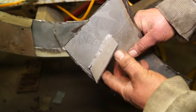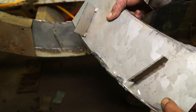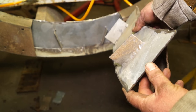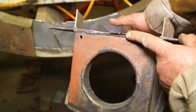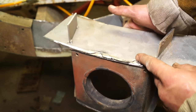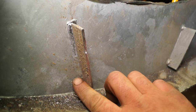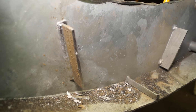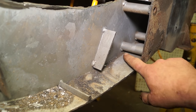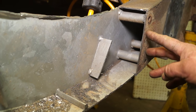Okay, so you can see I did actually start cutting the weld, realised it was welded on the back end because I couldn't see these weld runs at all. So basically this makes you think how this was constructed. I did make a mistake underneath. I took the grinder in to the side too much. Anyway, that's beside the point. What we're going to have to do is find a way to re-weld these back on again, and that's just another thing to do. You'll probably work out that they've fitted all these plates before putting the top and bottom on this chassis. As you can see, the welds are on these bolt tubes, top and bottom.